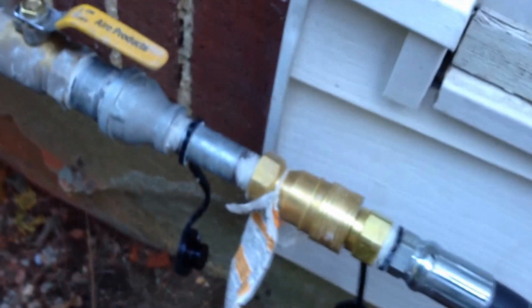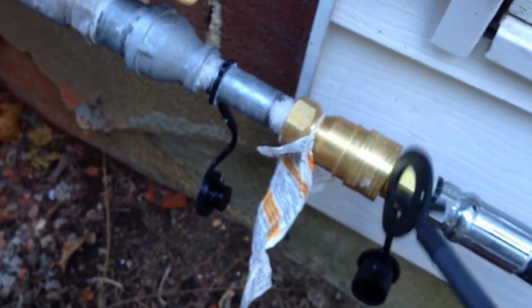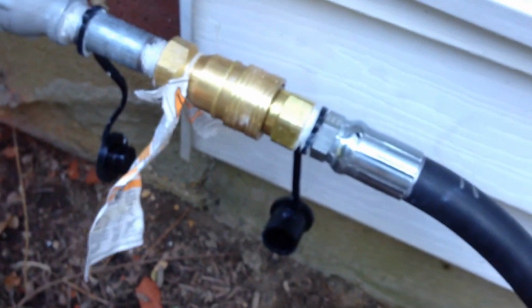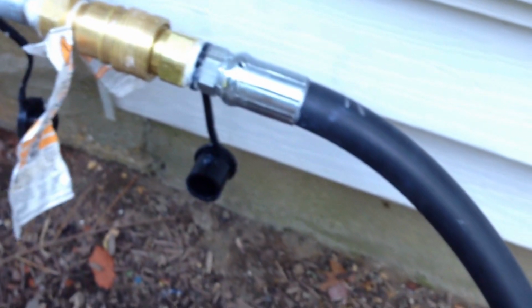One thing we debated is the hose coming in. We were always worried, do you need a 3/4 inch, do you need a 1/2 inch? Basically you want as big a hose as possible, a 3/4 inch. But if you're going to be taking it around to friends, you may want to reduce this to a 1/2 inch and use a 1/2 inch quick disconnect, not the 3/4 inch, because most, like the big Weber barbecues, use a 1/2 inch connection. So this way you could bring it around to your friends or your neighbor and just plug it into the Weber, if they have a Weber barbecue, to that same quick disconnect, and you don't have to change anything. Especially looking at how small this is, a 1/2 inch hose should definitely be fine. And I did look up the specs. This size generator is fine even on a 1/2 inch hose. So that's just something to think about.